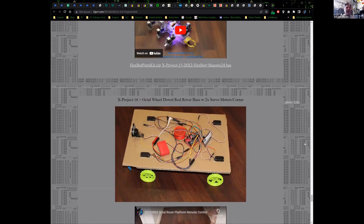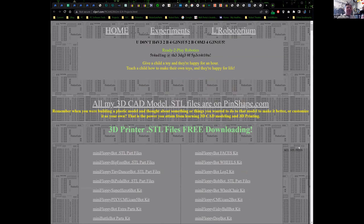And actually, a lot of this technology to control the stepper motors, servo motors, DC motors, and the speakjet chip, I've adapted with another little box I made. This little box I made plugs into an RS-232 port. And then you got your audio out over here. And then it takes 5 volts. I think it's just 5 volts DC in. I have mine hooked up to my Altair 8800 computer, so that it can talk and sing songs too. And I should have had that queued up.